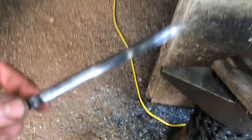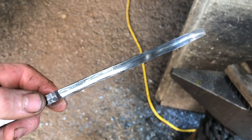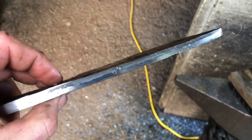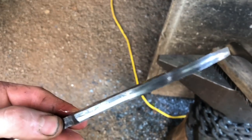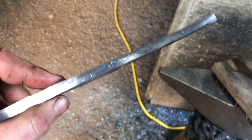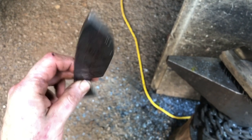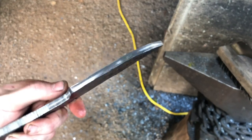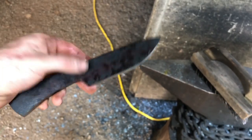After a quick dip in the acid, our core is definitely pushed off to one side down at the bottom, but up at the top it's pushed off to the opposite side — so the core kind of twisted during forging. I'm not entirely sure how to fix it, but when I grind the billet flat I might tilt the knife slightly to bring that core back closer to center. Good news is all the forge welds took beautifully, so it will be a functional knife — it just might not look as perfect as I'd have liked.